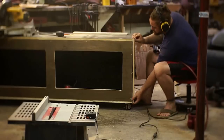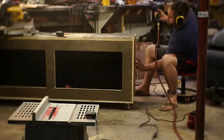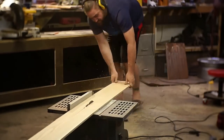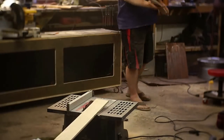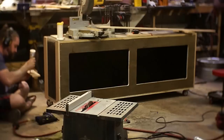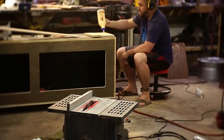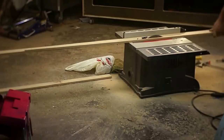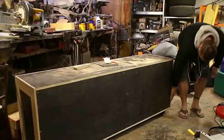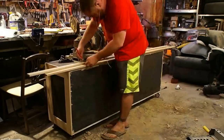The boards were real thick so I had to run them all through the table saw to get them down to their final size. I had done a rough calculation in my head and ended up with about 12 inches extra stock when I was done, so I guess I measured pretty well. After I got those first side pieces on it went a little bit slower, because I had to make sure the pieces fit exactly in between them without any gap — quite a bit of cutting long and then sneaking up on the final cut. Going through and ripping down the solid oak for the rest of the base trim. When I went to put this trim on there was a little bit of an overhang on the boards, so I'm using a hand plane to get everything perfectly even so there's no gap.